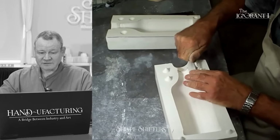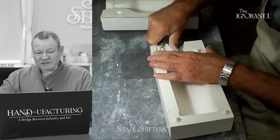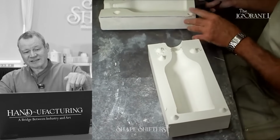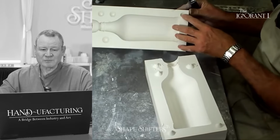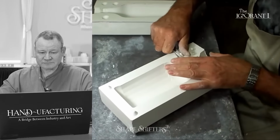Yep, keep the keys shorter. There's other reasons why the keys should be shorter, but sometimes clay gets into the keys and then the keys actually create a separation between the two pieces, but not often. Not with a mold like his, I wouldn't worry about it. His seam lines are perfect.